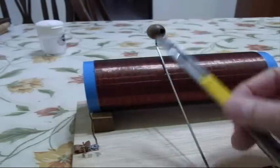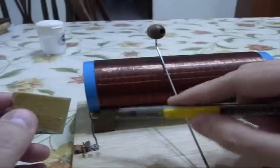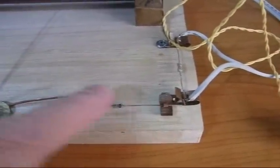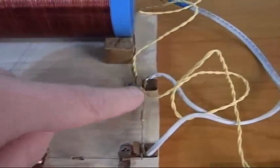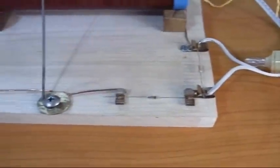For the end connections, to scrape the enamel off the copper I use a combination of a sharp knife and sandpaper. A lot of people will burn it off — I don't like to do that, it softens the copper. Just use a sharp knife, scrape the enamel off, make sure it's shiny all the way around the wire before you make your connection. Almost forgot: put your diode here — it doesn't matter which way it goes. Your resistor here — resistor has no direction either. Then clip in your earpiece, one wire on each side. And that's it — ready to use.